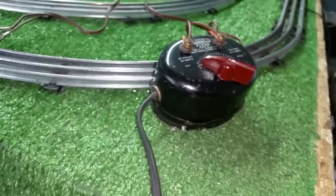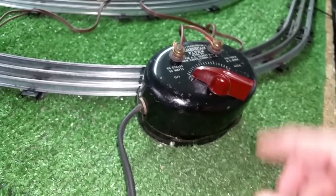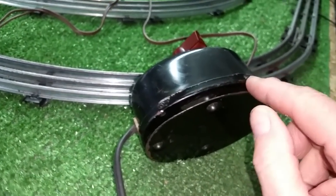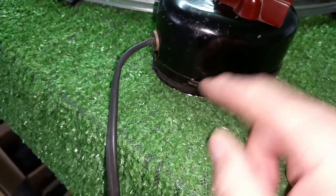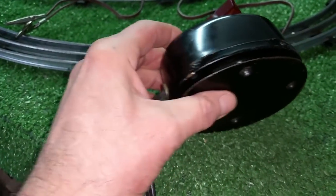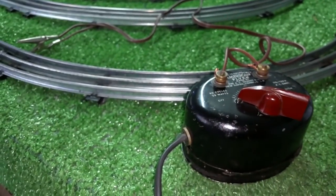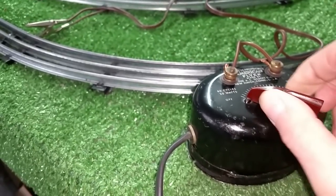The transformer is never going to work again — that's it. So I took it apart. The nice thing about American Flyer is that you can disassemble them. The bigger ones are held together with screws; the small ones are held together with detents — they just snap into these little holes, as you see. I used a screwdriver and got it started, smacked it with a light ball-peen hammer, and the bottom just popped off, which gave me direct access to the transformer itself. I pulled the transformer out. Fortunately, that point that had broken off of the wiper was still inside the case. So I located it, stuck it back in position, soldered it, and then reassembled the transformer.